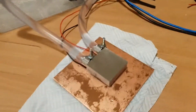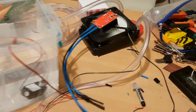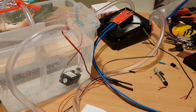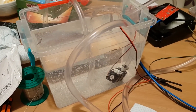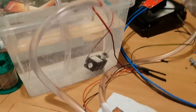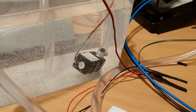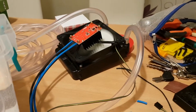With 300 watts of heat output coming out of this thing, there's no way that piddly little radiator is going to keep up with it. So the idea is this is designed for intermittent use — you cool the drink, then you drink it. We have a heat reservoir: there's five litres of water in there with a little submersible aquarium pump pumping the water around the system.